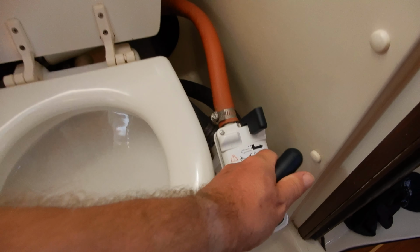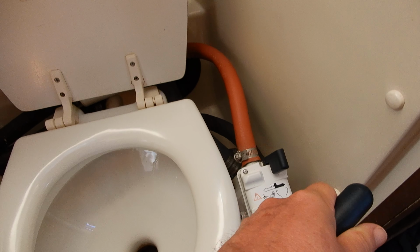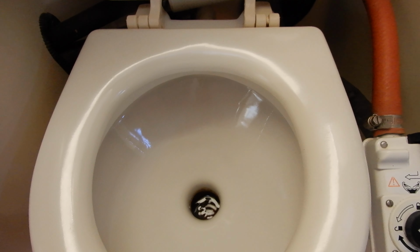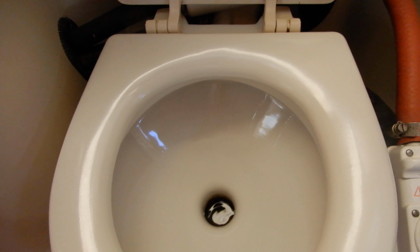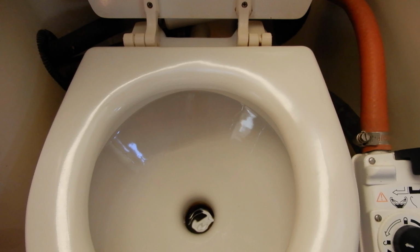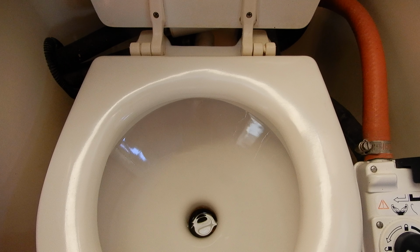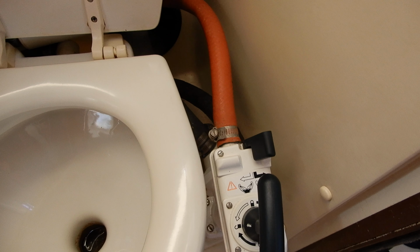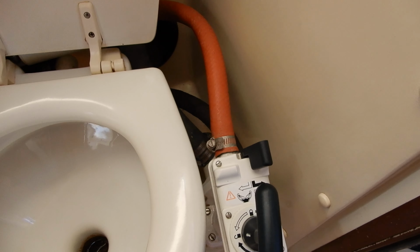So it's easy. Now I'm going back here, and then I pump one, two, three, four, five, six, seven, eight, nine, 10, 11, 12. By doing that, I can tell you the water is not going to come back. I have very clean water lines and septic lines, and I've stopped doing what I was doing in the past, because water would come back in the bowl, and constantly I was wondering what was happening, and I would change the joker valve, the valve system, the gasket, etc. And it was really just my fault.